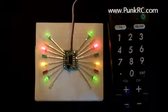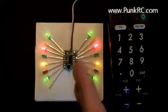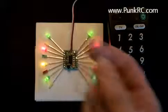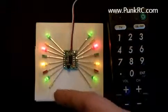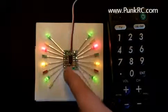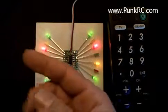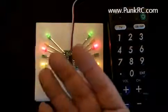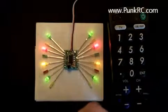Anyway, as you're wiring it, some considerations. These are important. These will help you out. Left and right, you'll want to do opposite sides of your plane where applicable, like for your different wings, so for your strobes, do left strobe, right strobe. Another thing is all the positives are on the top of the board, or if you're using the pin headers or the screw headers, they'll be labeled. All the positives are the same. So if you have a wing and you have four lights on the wing, you can run one positive, and then coming back, you'll run four of the negative LED wires into the bottom of the board. So that's basically how it's set up.